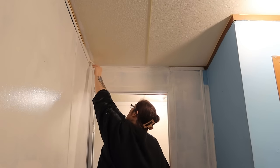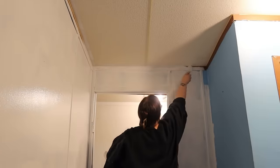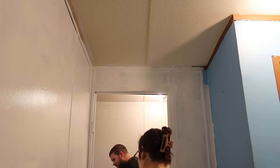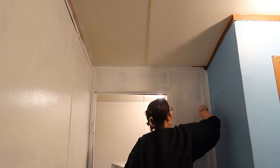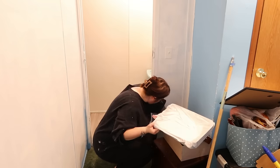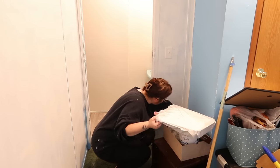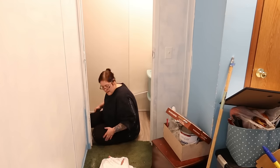And we're going to get a nail gun. I don't know if you have to use nails in there, but he mentioned a nail gun. If we're going to do it that way, he wants to have a nail gun. That way he can make sure that it's secured to what's underneath that other subfloor. And that's the reason why you would generally want to take the subfloor out. That way you know what you're screwing into and it's secured. But this way, it will be secured because we're just going to put them everywhere. And then we're going to do the peel and stick on top of that.